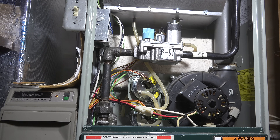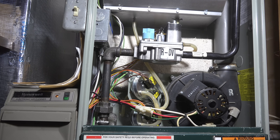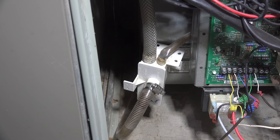The simplest thing I can do: this is a 90% furnace, and this only works on 90-percenters. Look down and see if you can find a condensate drain, because there's condensate coming off these things. Another thing to look at — when the inducer goes to start, does it make noise? Does it sound like there's water in it? That's giving you an indication that you've got a blockage in your drainage system. With the cover off, I'm looking at this — it doesn't look mounted very well; there looks like there might be a kink here. I'll link you to a video on how to clean that.